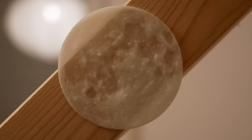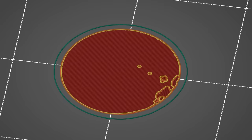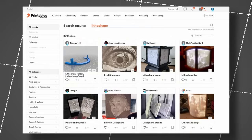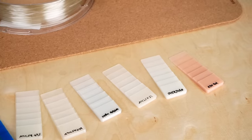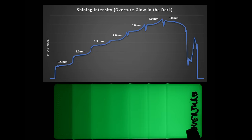One design I made for my daughter that I'm really proud of is this moon printed with different thicknesses, so some areas are brighter than others, which mimics how the moon really looks. The thicker the material, the brighter glow-in-the-dark prints usually are — basically an inverse of the popular lithophane lampshades. I tested this with stepped samples going from 0.5mm thickness all the way to 4mm. Looking at the brightness data, the increase is significant at first, but from 2mm and higher you get diminishing returns because the opaqueness of the material limits how much light can get from the center to the outside.